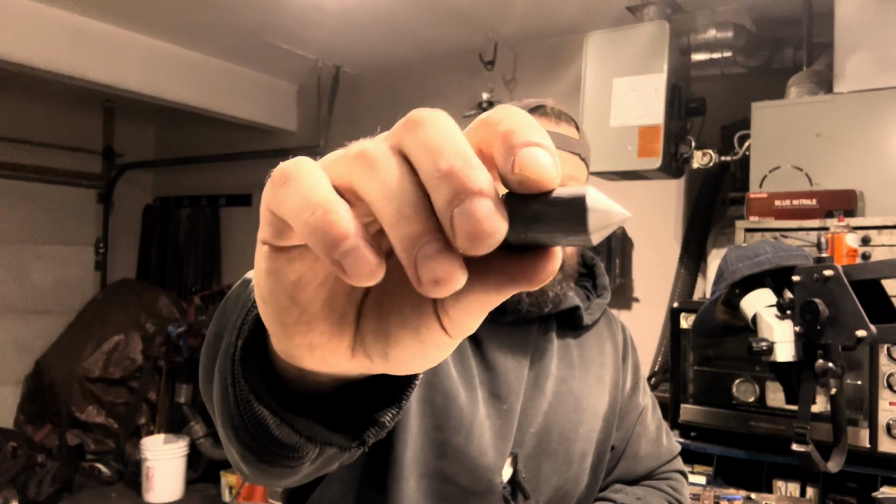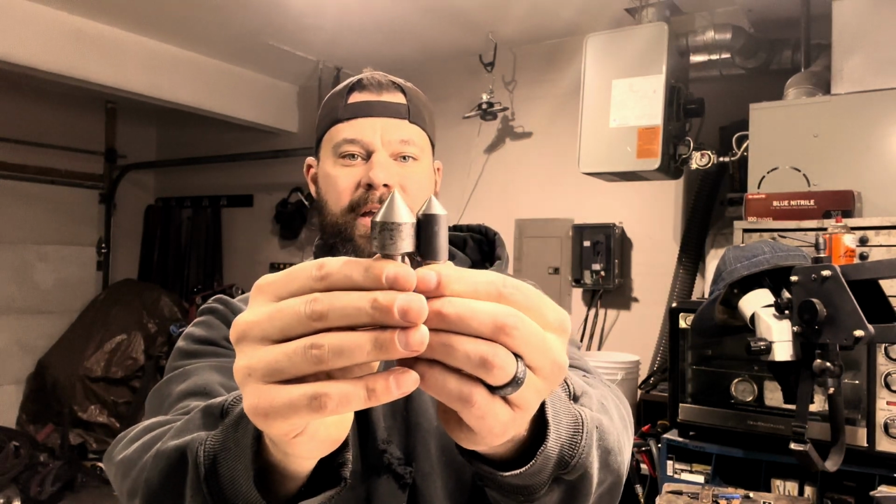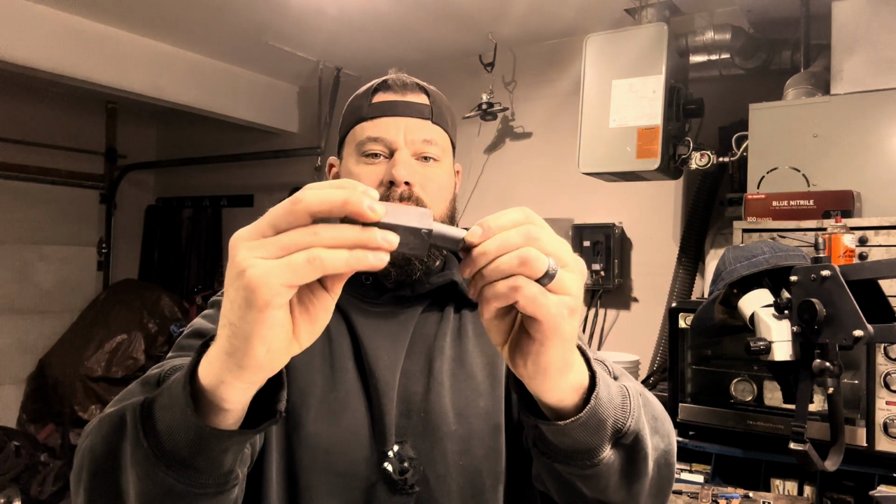Okay, so I got the spikes finished up. I think they're looking pretty cool. Now, one thing I did was shorten them up by 1 inch. They were 2.5 inches, and I did go ahead and make a larger one for the very top of the mace. So I think that's gonna be a cool addition. And a little installation tool. So I'll go ahead and weld a handle to this and head out to the forge and start fitting these spikes. So stay tuned.